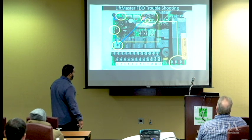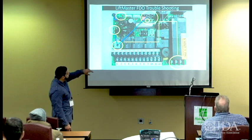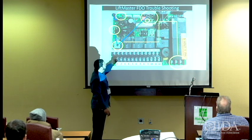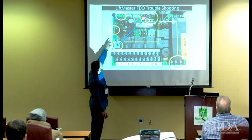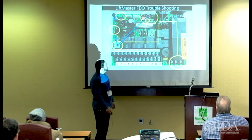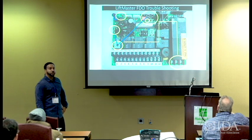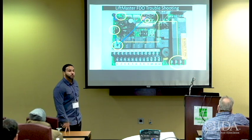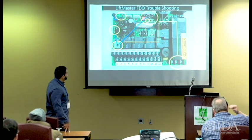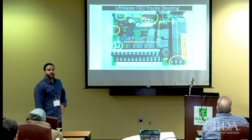So, all right, power comes in, we're troubleshooting this unit. Power comes in, rotates all the way over. By the time it gets over here, it's AC low voltage, and then it's DC, and it feeds in through the battery system that connects there, and then it goes over to where you've got those dip switches, then those actual prongs, and then it goes out to the brake. That's where you feed the brake power to. So that brake is 24 volts DC, and that comes back through. One of the things I would say about this unit is that if you can hook this one up, you're ready for any of them.